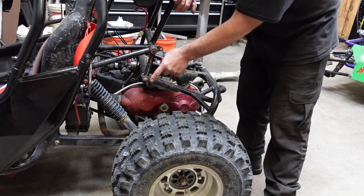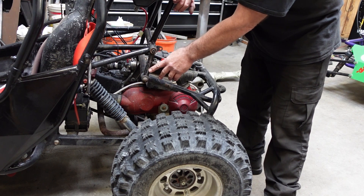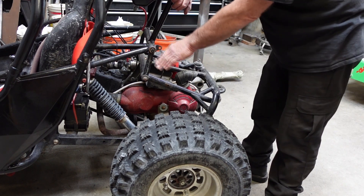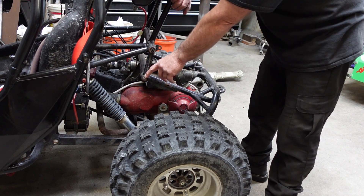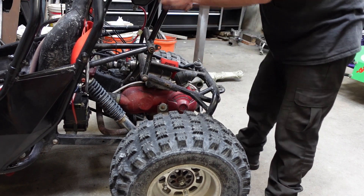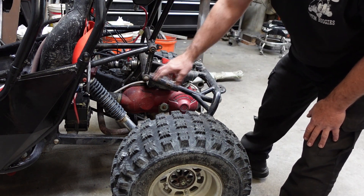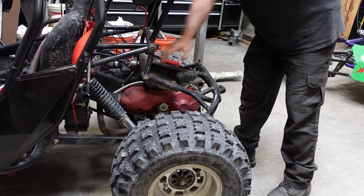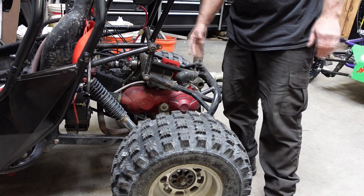actually point towards the gas tank. In a stock position, this dog bone needs to be pointed forward — basically the bottom needs to be pointing forward. If that's the case, you can't overextend it; it won't come up because of the angle change. If you put a longer shock and it causes your bottom dog bone mount to be behind the top one — anywhere from six o'clock back, roughly four or five — you're gonna get this effect. We want to avoid that because anytime the wheels leave the ground or you get rear-ended too hard, that can happen.